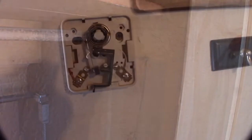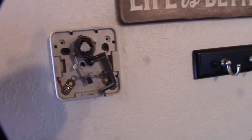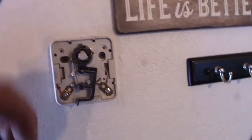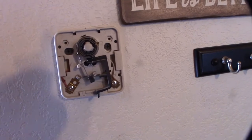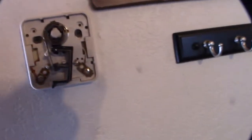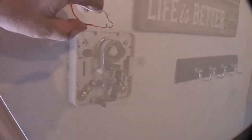Now I can run the wire back up through the existing hole. With this two-wire millivolt system, all you're doing is closing the circuit — power on, power off. That little coil inside basically expands and creates a closed circuit. It's low voltage so I'm not going to get shocked. And there we go — I just turned the heater on. Just like that.